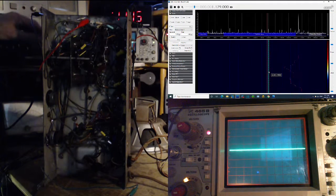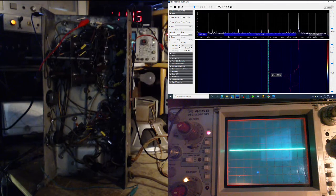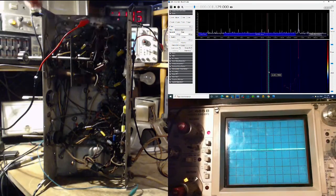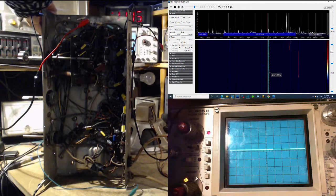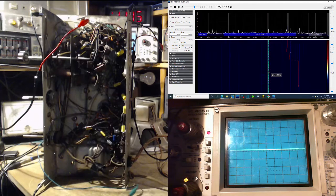local oscillator. So what we'll do now is I'm going to tune the radio so that on the dial it shows that it's on 1 million. I tune it into a million. So the radio is at a million. Now we can look at the local oscillator and determine the frequency of the local oscillator. Frequency is written up here, 1480. So you take 1480, subtract 1 million from it, you're left with 480.